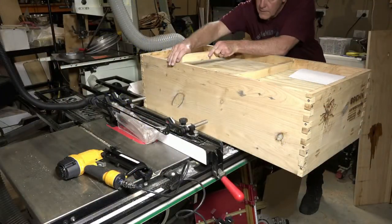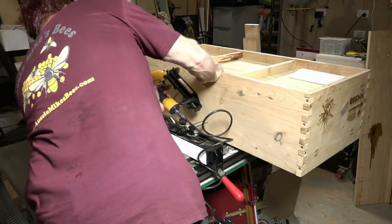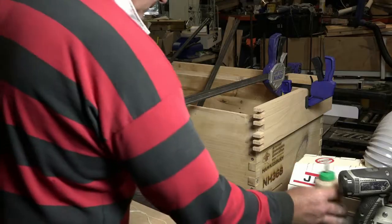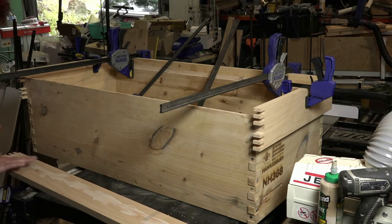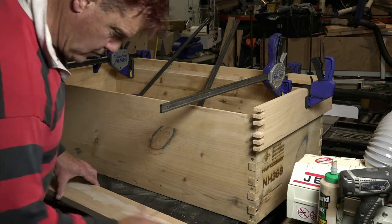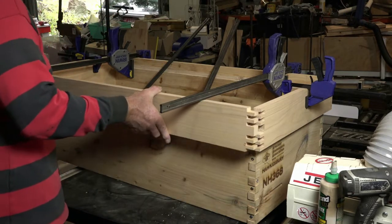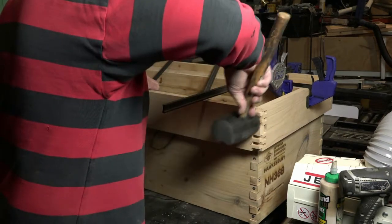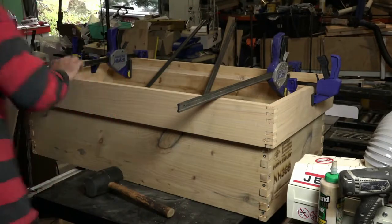I'm gluing and air nailing in these 2 little strips of wood just to give the base a little more support. We're in the home stretch of this part of the build, the base of the box. I'm gluing on the upper rim, and this will be the part that supports the roof via hinges and also allows that inner cover planks to sit in place.